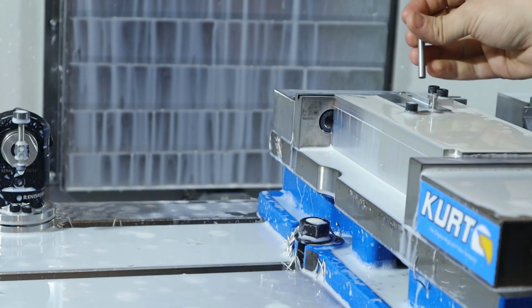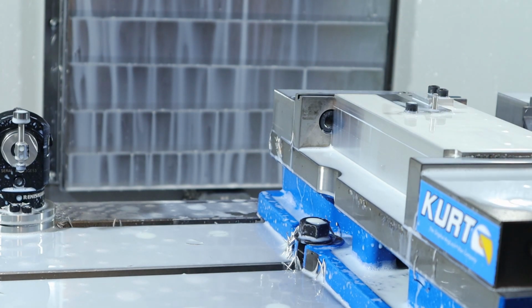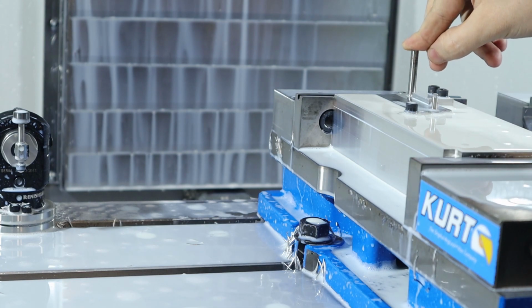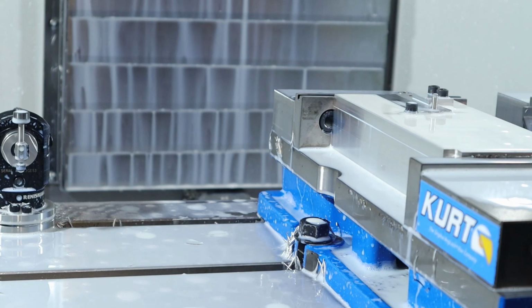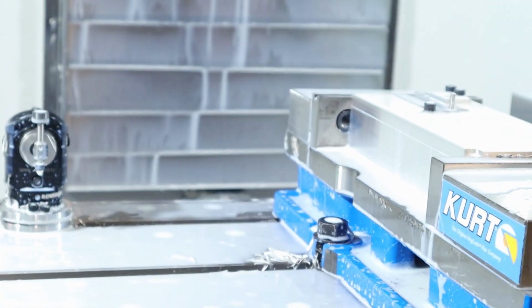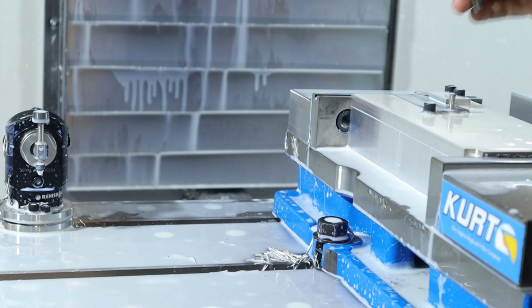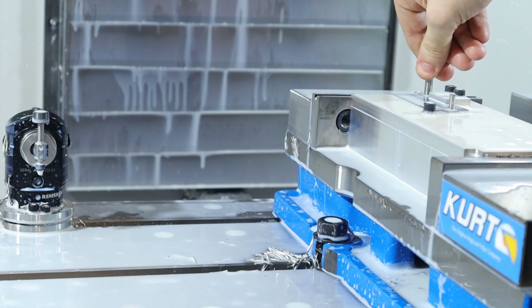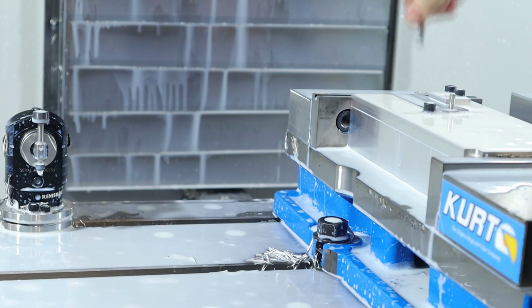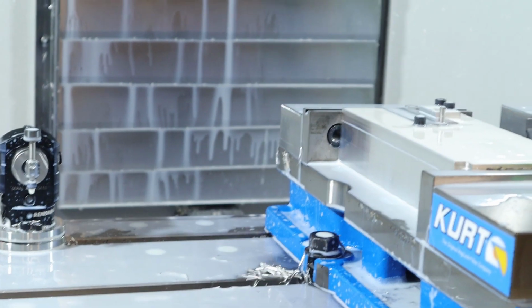Guess we'll stop it if we hear bad things. Okay, so the 250 doesn't fit. Here's the 245. That fits. 247. That's tight. 248. That fits as well, and very tight. 249. Barely goes in, so we'll just comp out 1 thou. 249. 250. It works. So, 250 it is. Alright, so that's good.